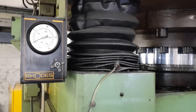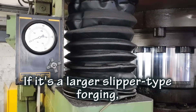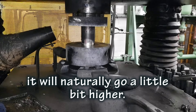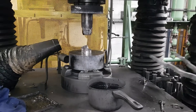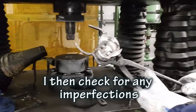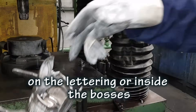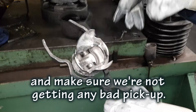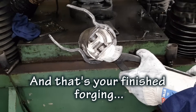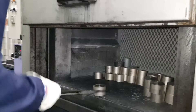These use around about 500 tons. If it's a larger slipper-type forging it will naturally go a little bit higher. I then check for any imperfections on the lettering or inside the bosses, making sure we're not getting any bad pick-up, and then that's your finished forging.